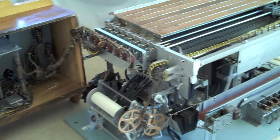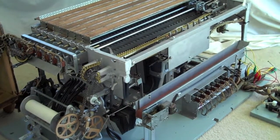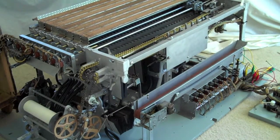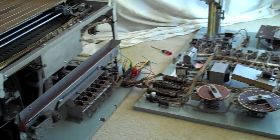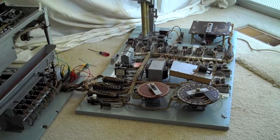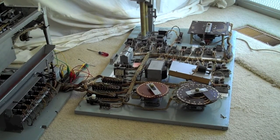Here's the mechanism that moves the horses forward, including the player piano roll in the lower left, the track in the top part of the picture, and a relay bank on the right-hand side which records the number of horses you've bet upon. This is the logic board — it has the payout tubes at the top, a payout score reel at the top right which helps drive that payout tube. The tilted box is a pinball machine which helps randomize the game, and the two score reels at the bottom help determine the number of credits bet and the sweepstakes winner.